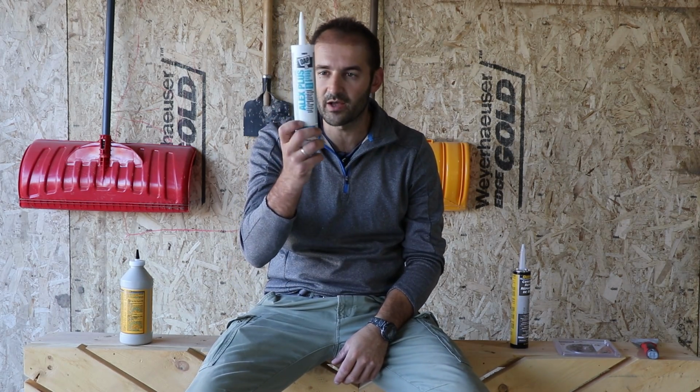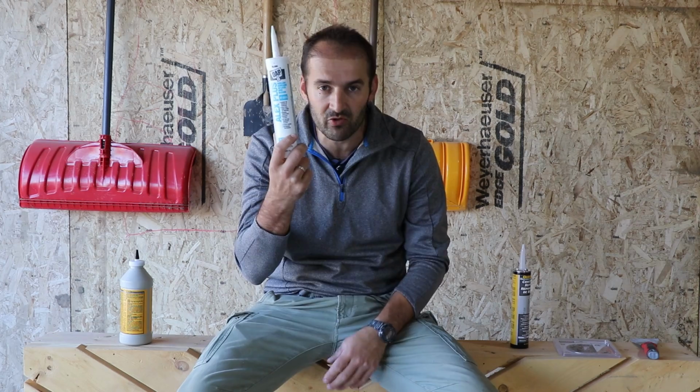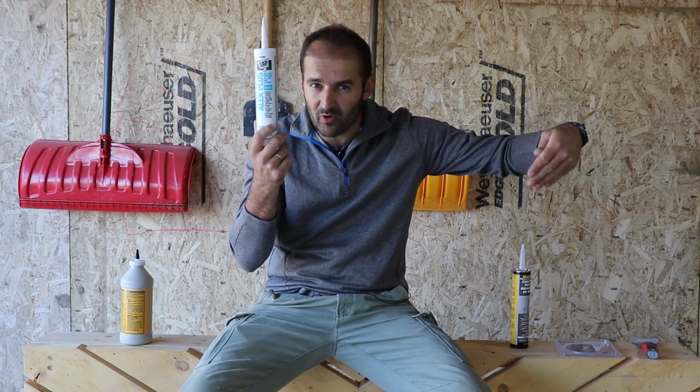And if you end up having a bigger crack, you're probably going to have to grind it down even more. And make sure you use something thicker. Thicker caulking. This is painter's caulking, $5 exterior, cheap caulking that you can find in any of the hardware stores, just to fill up the bottom of the crack.